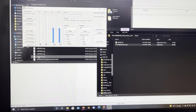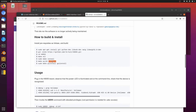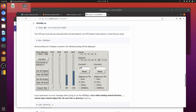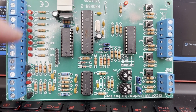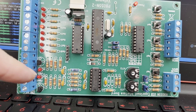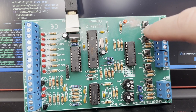Now let's see how we can do this on Linux. We ran it on Windows successfully. I git-cloned the project and followed the steps. I'm not building the pilot GUI — I don't need that — so I only did make. I don't set the sticky bit; I'd rather run with sudo. And now it actually works. The obligatory 8-bit Knight Rider scanner, plus the analog out, which translates a value to a voltage, so you can see those pulsing in and out. And we can stop it because these buttons are also scanned.